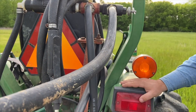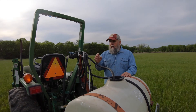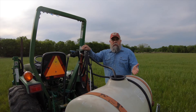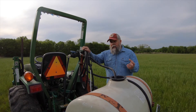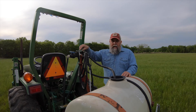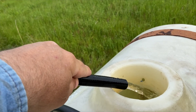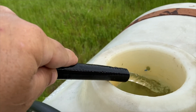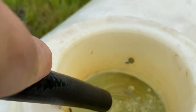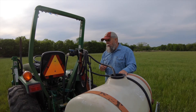The pressure regulator has a bypass hose coming out of it. You might wonder why you'd put water back into the system — that's what the bypass hose does. If you've got the system dialed to run one gallon per minute through the spray tips but the pump is moving a gallon and a half per minute, that extra half gallon has to go somewhere. When it hits the pressure regulator, the excess fluid gets bypassed back into the tank. It's a closed-loop system, and the recirculation helps keep any chemical solution well mixed throughout the spraying operation.